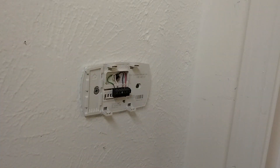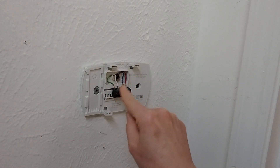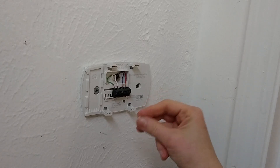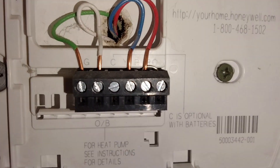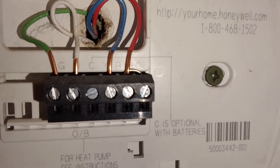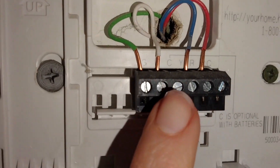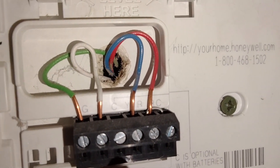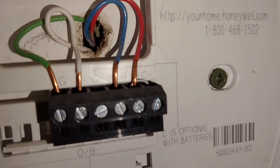What we're going to do is bypass the thermostat by jumping the wires together. You have to be very careful not to touch wires and short them out. A lot of people ask me what color wire - most of the time when you see Y here it is a yellow wire, but clearly you can see that is not a yellow wire. So remember: wire colors mean nothing.